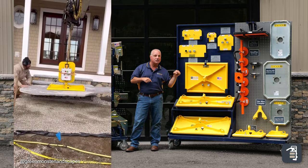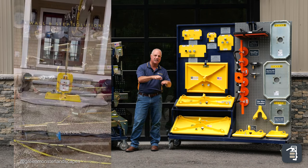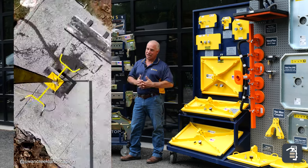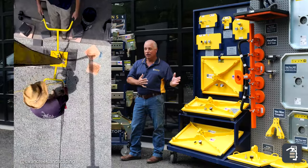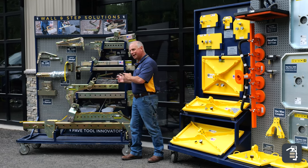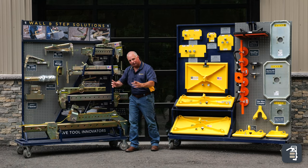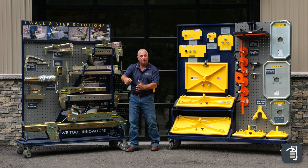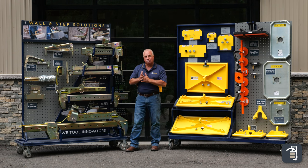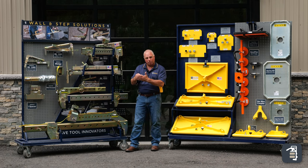You can set them nice and gently where you need to be. You can overlay and then mark, pull it back out, and reset it very easily. Large format products, even slabs, your steps and whatnot — vacuum equipment is going to be ultimate. The only time you might have a snag is if you've got a really irregular top, and then you're going to want to use a clamp. But sometimes with a clamp, if you have irregular faces on it, it can be really hard to find that sweet spot to get your clamp hooked on and pick that product up. A tip: a little piece of foam, rubber, or even a piece of plywood if you're worried about marring that surface.